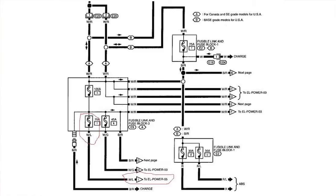If you have an amp that has multiple circuits or multiple inputs, then what you want to do is plug your guitar into another circuit. If the fuse does not blow at that point, then you've isolated the problem.